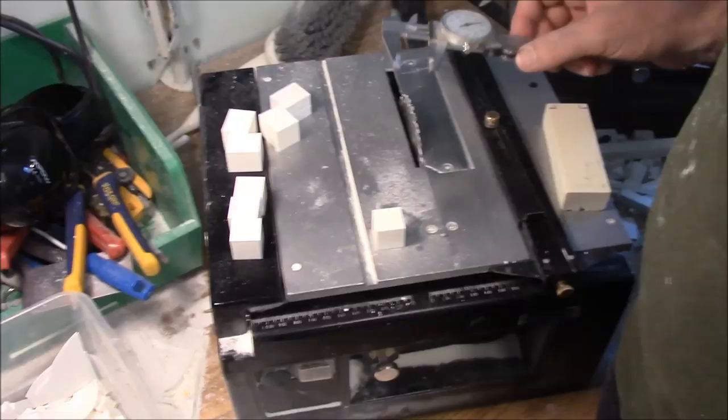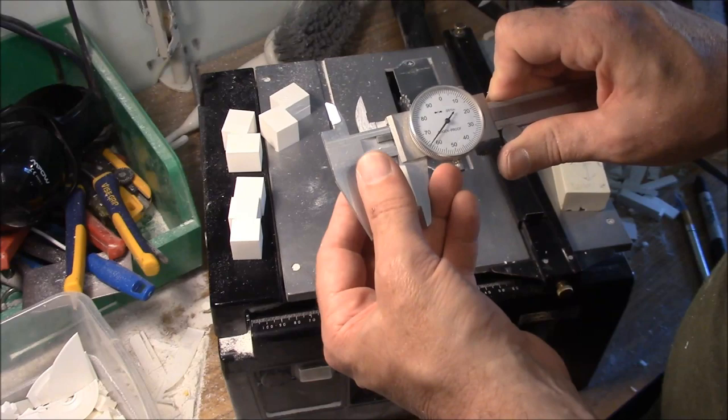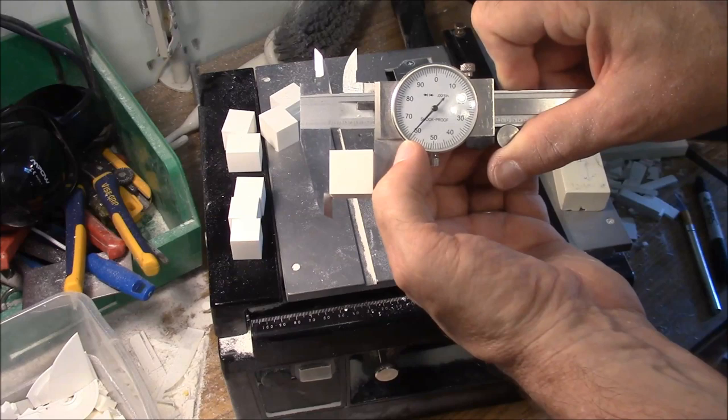Okay, we got them cut and they look nice. And let's see how well we did. What we wanted is 10 1,000ths over 0.75 of an inch. Let's see, put it on there. Pretty darn close. I got it within about 1/1,000ths of an inch. Okay, right now it's at 0.76, and then two more marks down would be 0.75, which is exactly 3/4 of an inch.